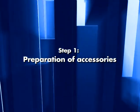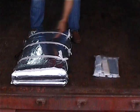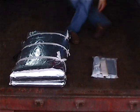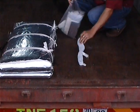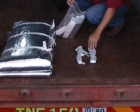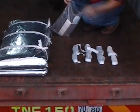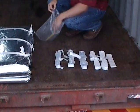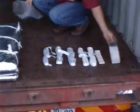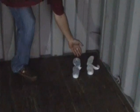Step 1: Preparation of accessories. Place in a convenient fashion all the necessary accessories. Check to see that you have 5 pieces of lashing, foil tape, and optional double-sided adhesive, and the liner. Only 4 pieces of lashing are used; an additional piece is provided as spare. Place one pair of lashing at each side wall.